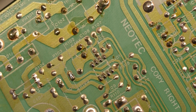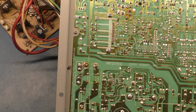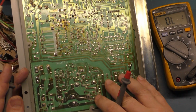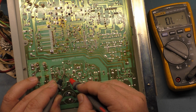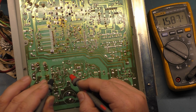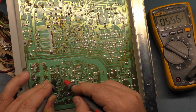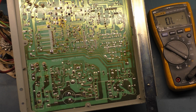Okay, now, just out of curiosity's sake, let's take some readings again. And I think these two didn't give us anything. Yeah, see, now we got a diode there. Boom, 0.5 voltage drop. 0.693, I think that was 0.7, so that's the same. And then we had voltage drop here, yep, okay. And, all right, well, I am confident now that we have voltage drop across these two pins that it's probably going to work now. So let's flip this back around.